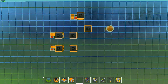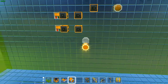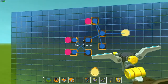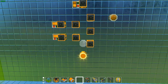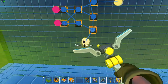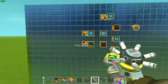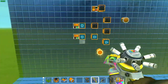And lastly we'll be making our carry work, so we do a wire there for the carry. The AND gate will be hooked up to the carry-in on this extra gate. The carry output will be this OR gate. So the carry-out will be on if there's two or three of the inputs on. It doesn't matter what two or three — if it's that amount it'll be on, otherwise it'll be off.